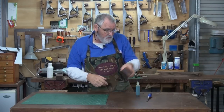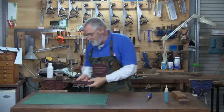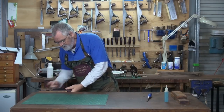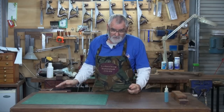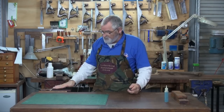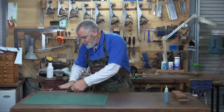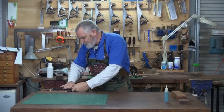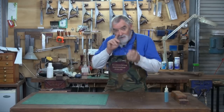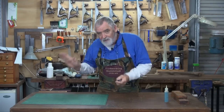And if you've got one, or you've got an old bit of leather hanging around, touching it up with a strop will make it even sharper. I don't use any compounds on this strop at all. It's just pure leather. You can use an old boot, or go to a boot maker's, where you'll most likely get enough cut of suede or whatever, put it on a board, and then it's just a question of giving it a couple of licks. When you're using your chisel, it'll actually start to blunten a bit. Instead of going back to the stone, go back to the strop.